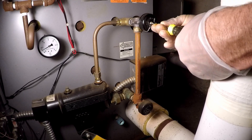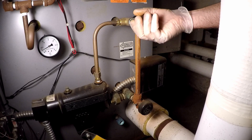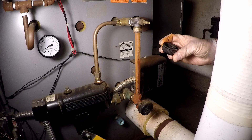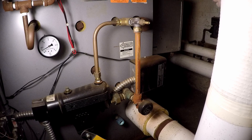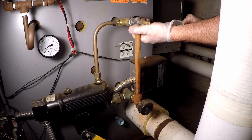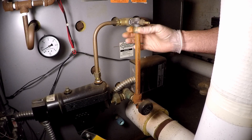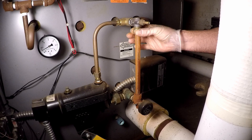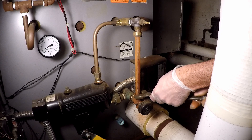It's kind of an interesting little process. The function of this sight glass is to show you exactly where the water line is in the boiler without having to look inside, obviously, because it's cast iron. On the boiler itself, there's a line with an arrow showing where the water line should be — that's for safety, so you don't overfire the boiler or have too much water, which can cause over-pressure problems.